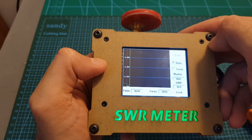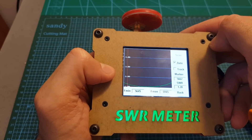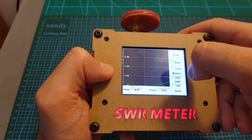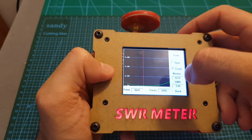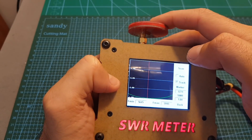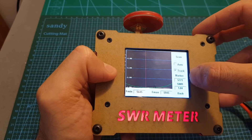You can see the PokerChip starts at around 1.28 SWR near 5.645 gigahertz and gets to around 1.49 closer to 6 gigahertz. The minimum value is around 5.8 gigahertz where the SWR is about 1.04. From this test we can deduce that if you're going to use this patch antenna, the ideal frequency to use will be close to 5.771 gigahertz.